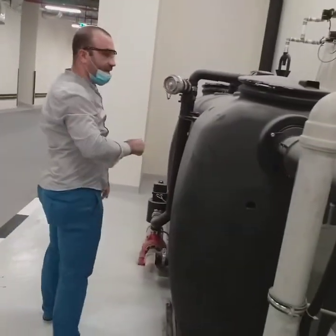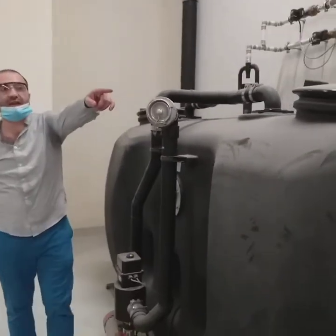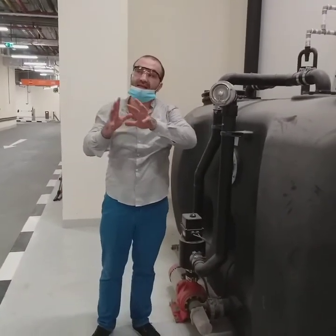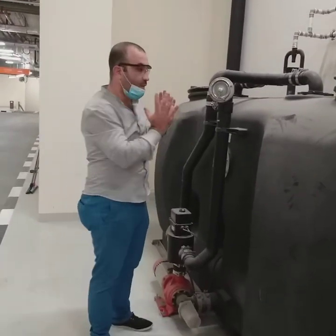Going back to the system here, we have to clean once every month, and we have a monitoring there that will be telling you the grease level. Now, the maximum grease level should not be exceeding 67% as per the design selection. We are designing to have a safety factor where this will be cleaned.